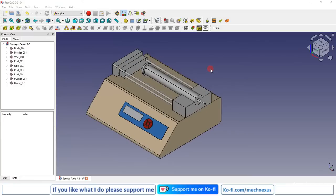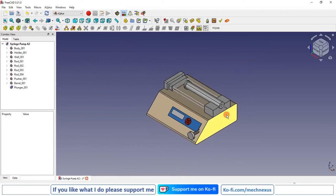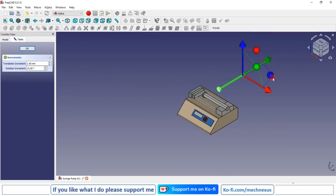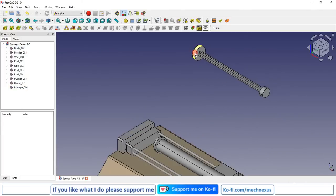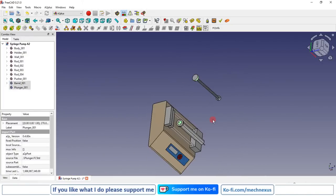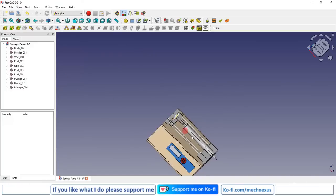Next part which we are going to assemble is a plunger. I will select add part and select the plunger. Now I will select my plunger, click on the transform tool and I will rotate it as per my orientation and I will accept it. Now I will make the concentric relation with this and inside face, accept it.